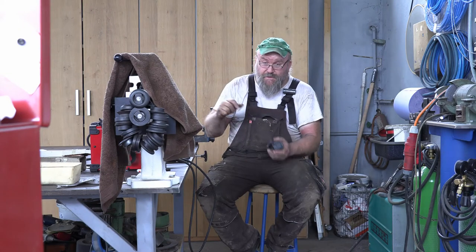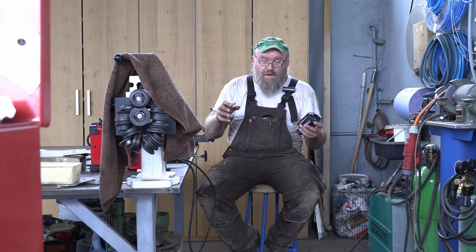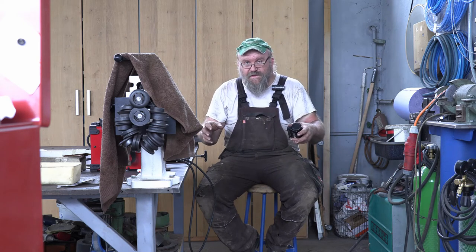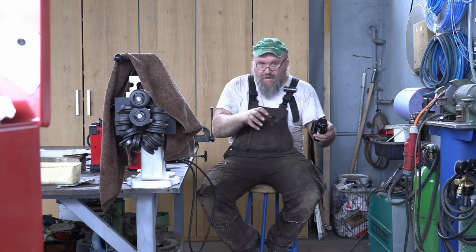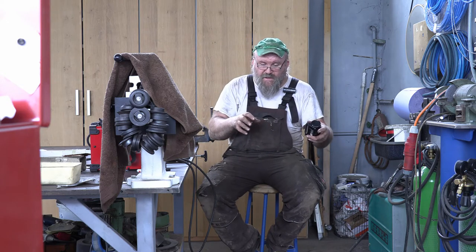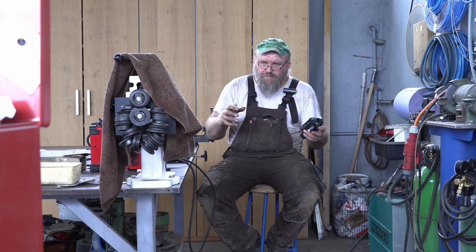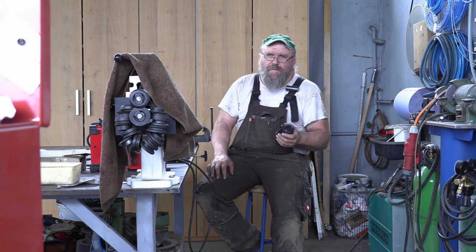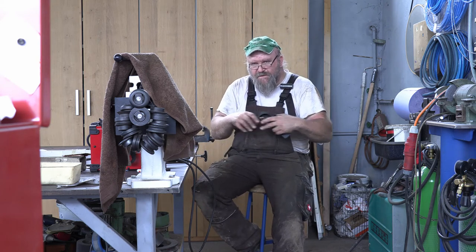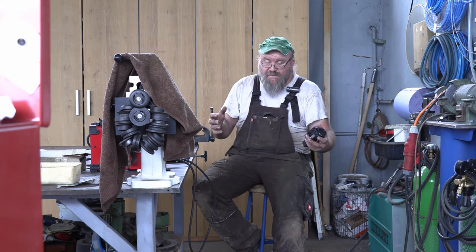As you can see, there's hardly any reference surfaces on there. In order to get a reference surface, we mounted things up on the mill table and ran it back and forth to see whether one end and the other end was within plus or minus half a millimeter of one another. As it turned out, it was negligible — less than a tenth or two — so we wound up squaring that up, and then on the front of the thing making a reference surface so that we have something to measure off of.